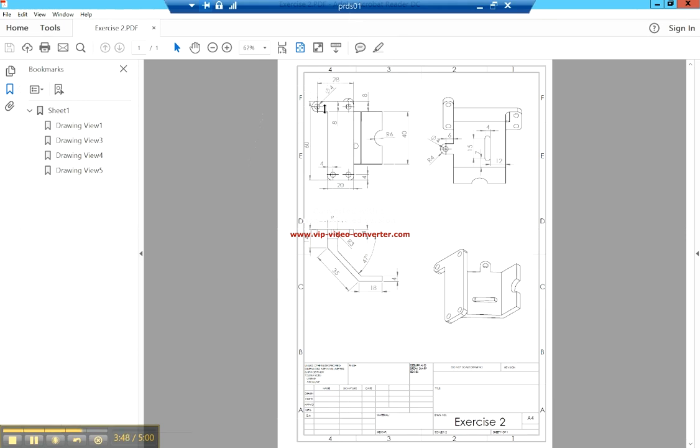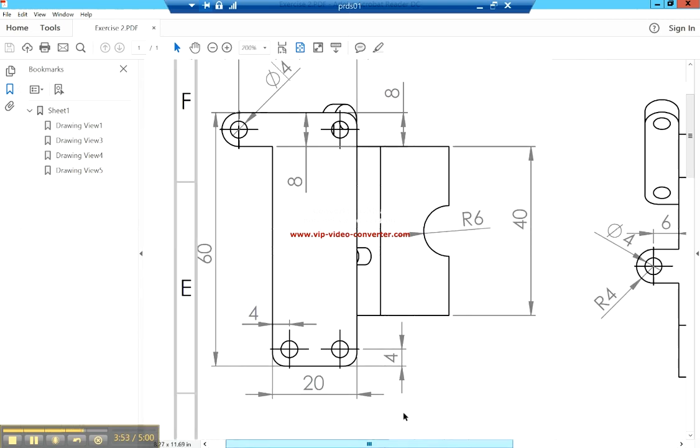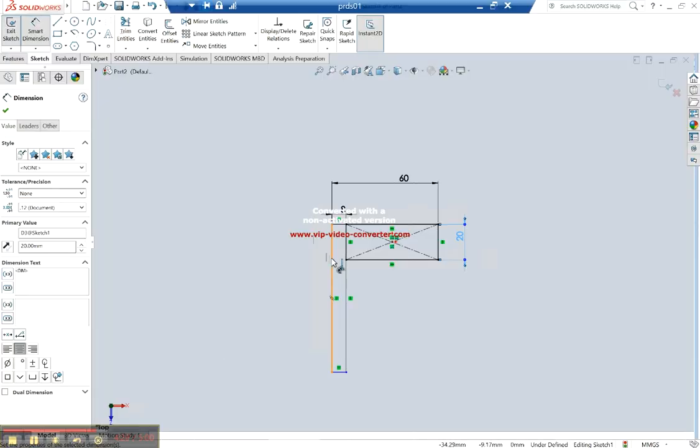If we zoom in, we can bring that up. Well, we know from here right down to here is 28. Now we know, well, if this diameter is 4, well then from here to here the radius is going to be 2. And we also know that because the width of this is 8, this is a radius, this would be a radius of 4 to the top. Okay, so you're going to get 28 plus 4, 32 in the length. So let's put that in.